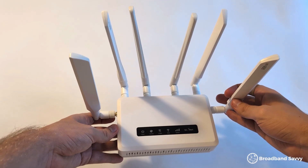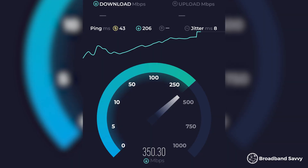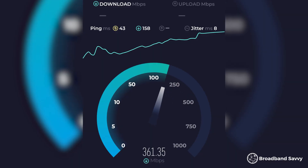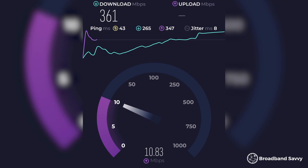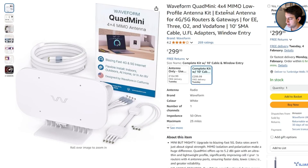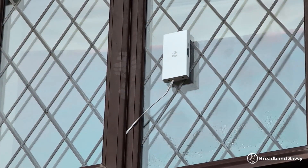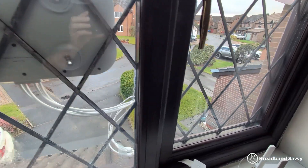For our final test, we took our GLiNet GLX3000 with all of its bunny ear antennas installed and ran a baseline speed test. Similar to the TP-Link Archer NX200, we get a download speed of about 300 to 350 megabits per second and an upload speed of about 10 to 15 megabits. Then we removed all the bunny ear antennas except the two Wi-Fi ones, and hooked up the Waveform Quadmini — a 4x4 MIMO antenna linked on Amazon in the description — which you can install on the outside of your house, basically the exact same way as the Three 5G outdoor hub does.